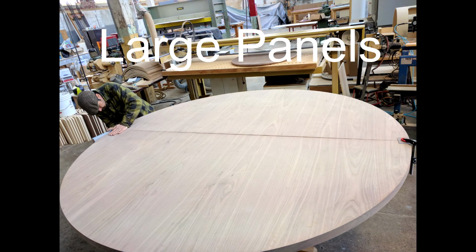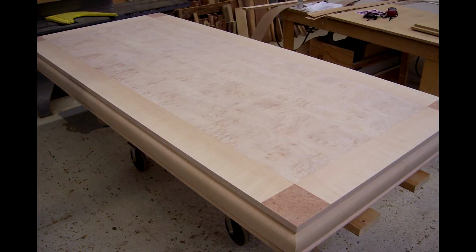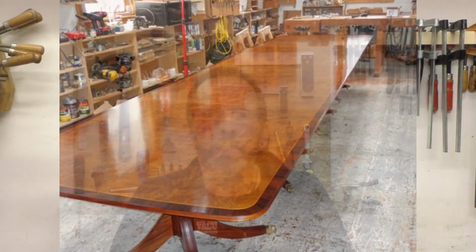6. Large panels. This situation does not necessarily relate to rigidity, but it does relate to the glue's open work time. PVA glues tack too fast to practically roll out an entire 4x8 panel and get it in the press fast enough. Urea resin glues, as well as epoxies and polyurethanes, have much longer open time to accommodate large panels.